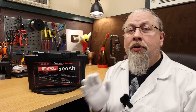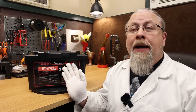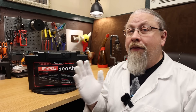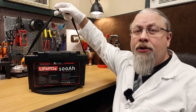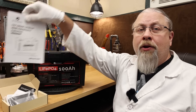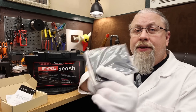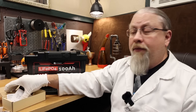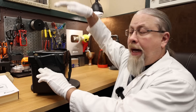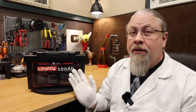The PowerMax offers both hot and cold temperature protection — this battery will not charge below freezing. That's a very exciting feature for those living in cold climates. It comes with a large nylon carrying strap and battery mounting hardware — a couple of steel plates to mount the battery to a hard surface. They include all the nuts, bolts, and screws, as well as brass hardware for the connectors. These batteries are also stackable thanks to recessed terminals, so you can still access cables when batteries are stacked. And Dr. Prepare offers a class-leading 10-year warranty on this product.